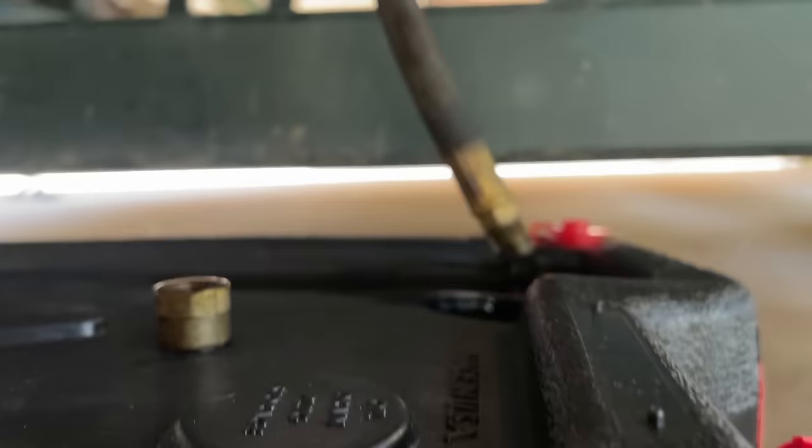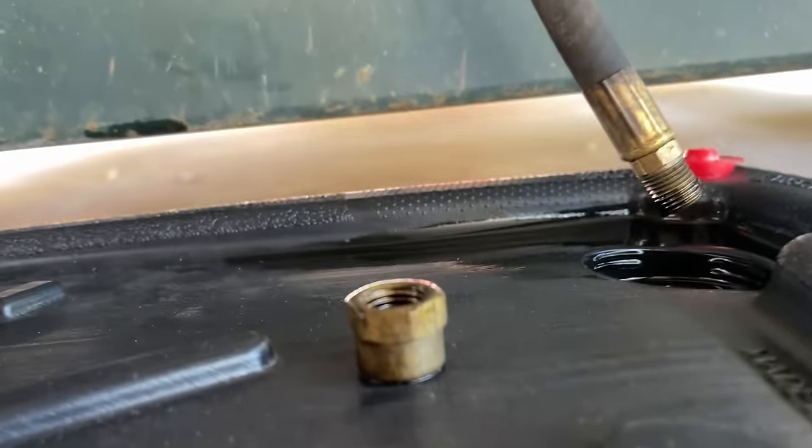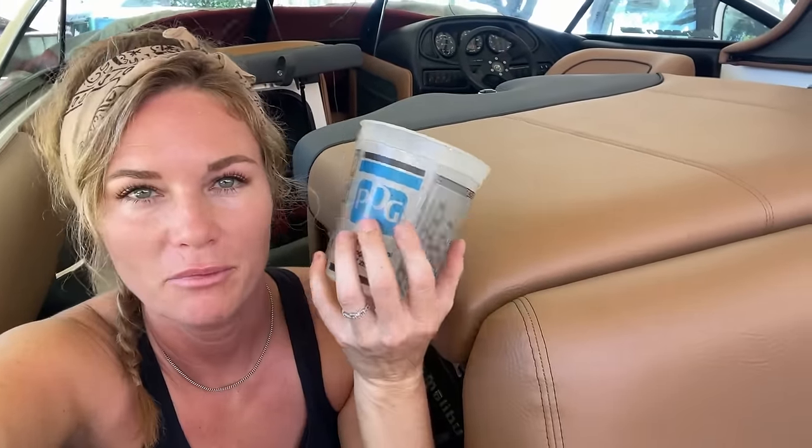Done draining — let's put the cap back on and go up top. I'm in the boat. I did well by remembering a filter wrench, but this filter wrench is not big enough. The oil filter is bigger, so I'm gonna try tightening this big hose clamp down on top of it and then with a screwdriver hit it with a hammer to break it loose. I also grabbed this little plastic paint mixing cup — it's big enough to go around the filter so that hopefully when I get it broken loose I don't make a mess inside the bottom of the boat. I know the hammer-screwdriver-into-the-unit method works but that makes a mess, so I'm trying to avoid that.